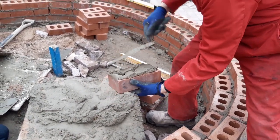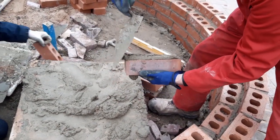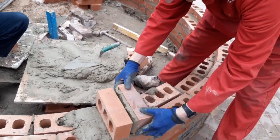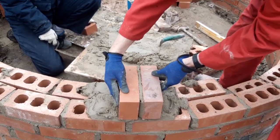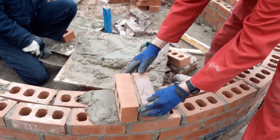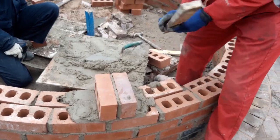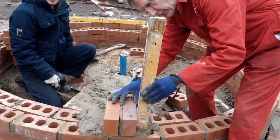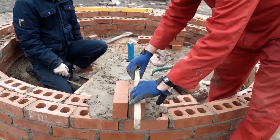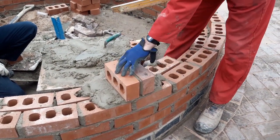You want to make sure the edges are nice and full, so the edges are full. You don't want any mortar on top, so I'm just going to put the two on like that. We're also going to set up a line to make sure we're keeping in line. The next thing is to make sure it's vertical, so pull that one over to make sure it's nice and plumb, and obviously you want it level or at least have a slight runoff.